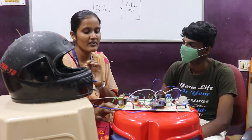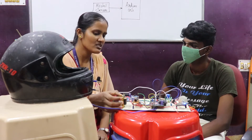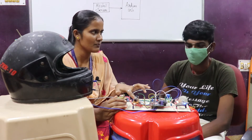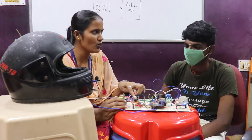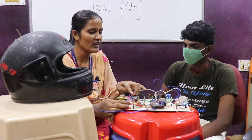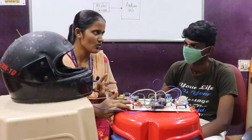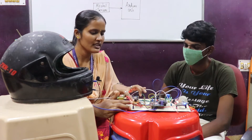After the step-down transformer, we receive 12-volt AC voltage. We then need to convert AC to DC, so we are using a rectifier here. The purpose of the rectifier is AC to DC conversion, giving us 12-volt DC on the output. This capacitor unit acts as a filter — we use it because there are fluctuations in the AC-to-DC conversion and we can't receive clean DC without filtering.